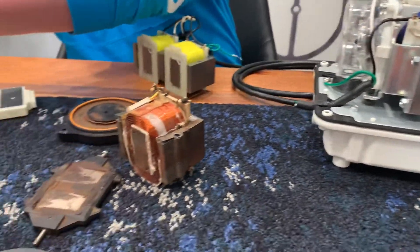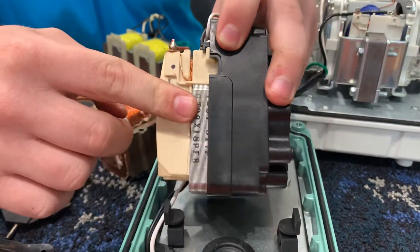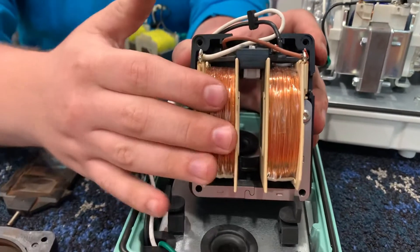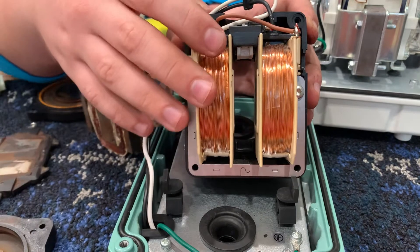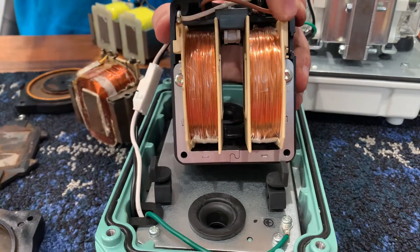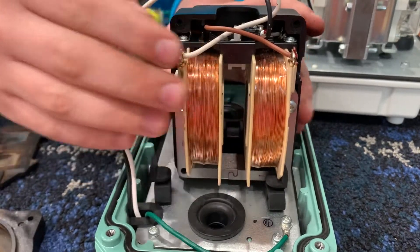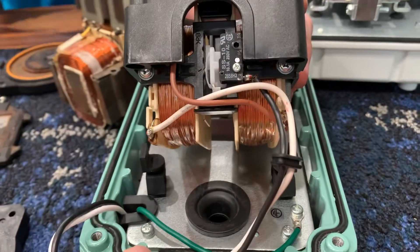Here's another more energy efficient model. You can see by the orientation of these metal sections, and these are the coils we were looking at earlier. Right in here is that space that the magnet goes into. You'll have current come through this wire and that'll create an electromagnet — one on either side of the permanent magnet that goes in here. Once you have that alternating current, it's going to cause that permanent magnet to move back and forth. If one of those diaphragms on one of the sides breaks, one of those tabs will catch the safety switch up top, causing it to move to one side and shut off the pump.